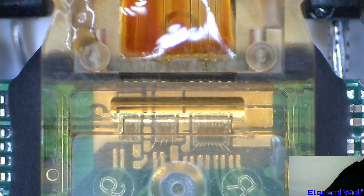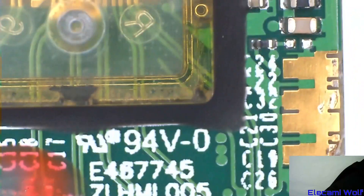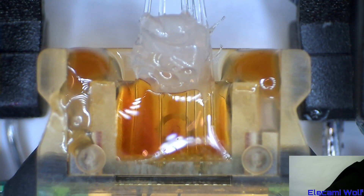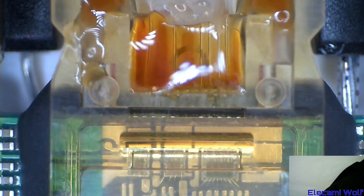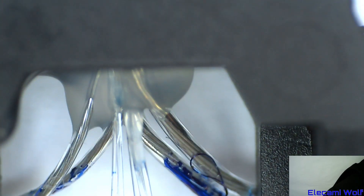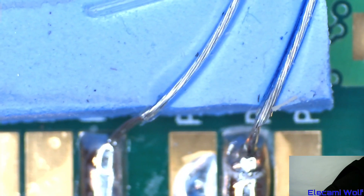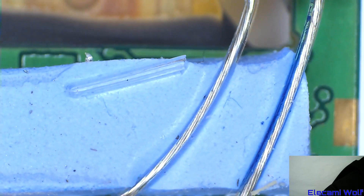As you can see the positioning there — the two on the left are quite spaced apart, which is one transmit and one receive. Then on the right there's the group of four for the video data. One thing I was wondering: can we see the insulation on the electrical conductors? And we can. Let's turn it over. So that's soldered down to pads, and you can see there's a very thin, clear insulation over those wires — kind of like the buffer material that's on fibers.